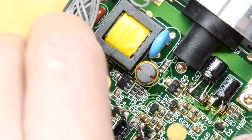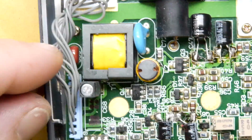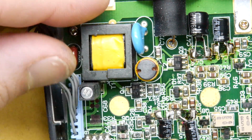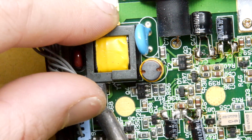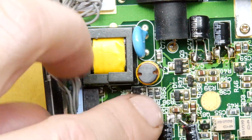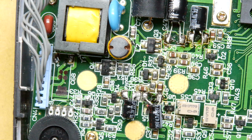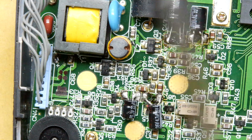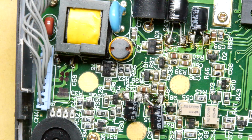I might do a slightly different technique where I'm going to bend this up gently, not so much that it rips the pads out, because I'm going to get in from behind, because there's no way of getting in there with that transformer in the way. Boom! Shakalak! Look at that. That wasn't a problem at all. I'm then hitting them. I'm pretty much touching it with the solder. Again, remember, we're talking through the technique here.